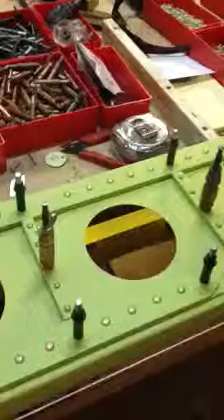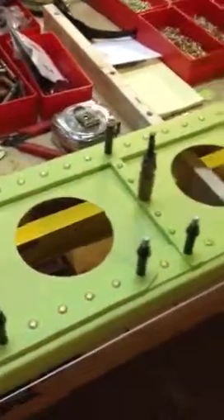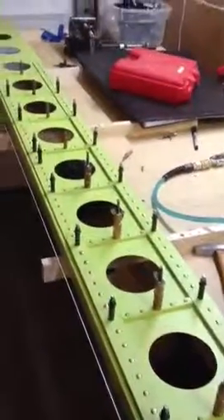Hopefully by tomorrow evening we'll have at least some of the rivets driven on this. There's 138 — so 276 rivets I believe just in the cap strips. And then there's another 20 over here, and way down here at the splice I think I counted 54 in the splice. So you're looking at 300-plus rivets. We'll see how it goes. Hopefully tomorrow I've got a great update for you. Until then, we'll see you in the shop.